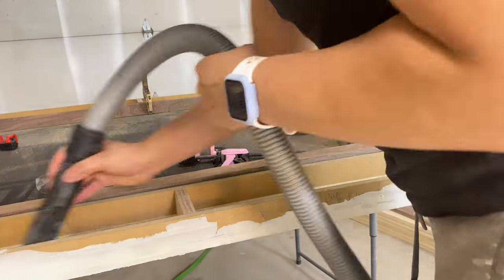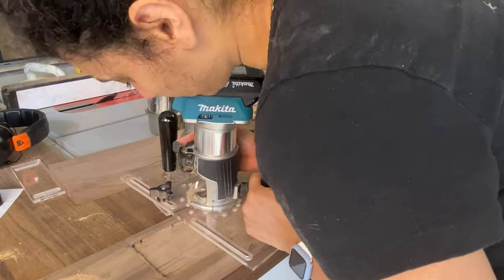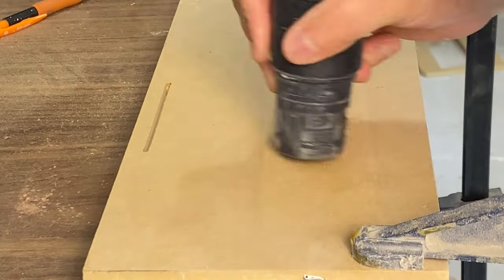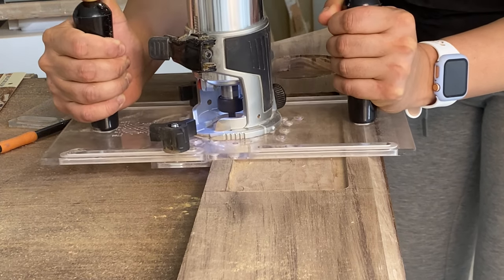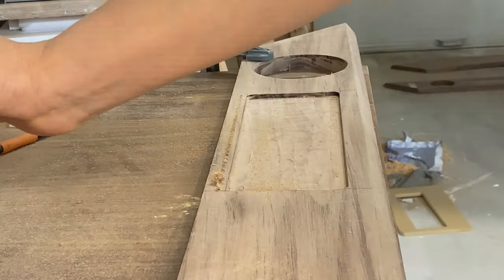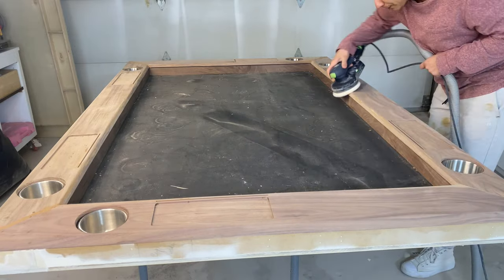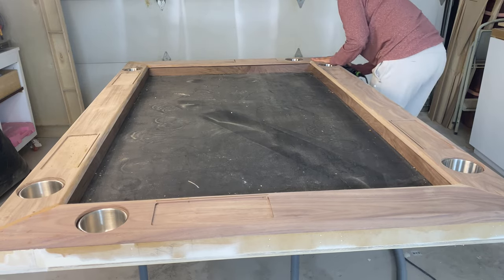After cleaning the inside it was time to glue the walnut top, but before that my husband had a second request — he wanted a card slot, which makes sense on a game board table. I tried it on a scrap piece first because I didn't have much room to make the groove. I bought the tiniest router bit I could find and then did the final piece. I have to say that sanding those little corners of the slots, the card slot, and the groove was the hardest thing in the entire project.